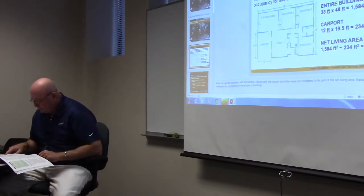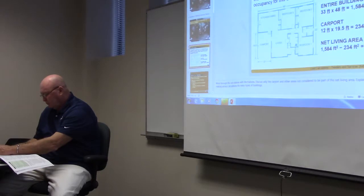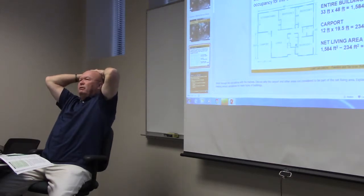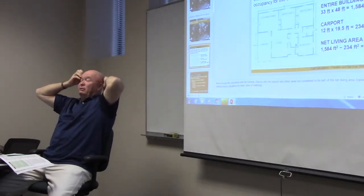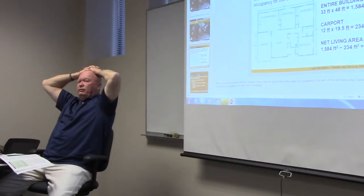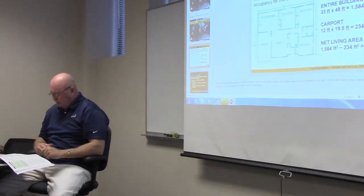According to NEC 430.22, a single motor shall have an ampacity of not less than blank of the motor full load current rating. 125%. Yeah. And what does 125% represent? Why are we doing 125%? Continuous duty. A motor, unless it's stated otherwise, is continuous duty. Some are intermittent or other 30-minute cycles or whatever. Those are not. But unless they tell you, it's a continuous rating.